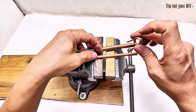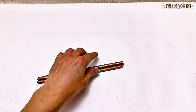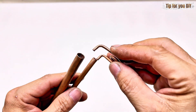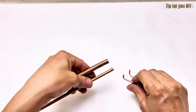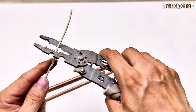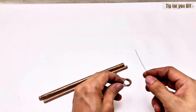Drill through the two copper tubes to create holes to install the capillary tubes and solder them. Next, take the medium-sized copper pipe and bend it into a smaller coil — this will serve as the condenser. Finally, prepare the smallest copper pipe, the capillary tube. This thin pipe controls how much pressurized gas enters the evaporator, creating the temperature drop.